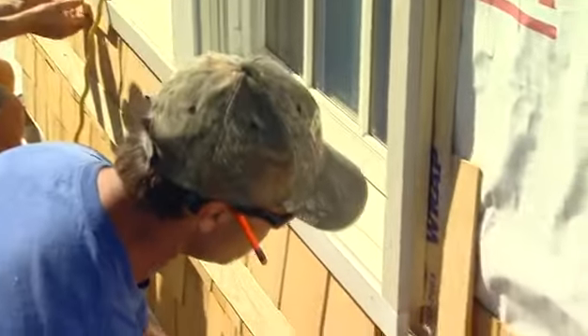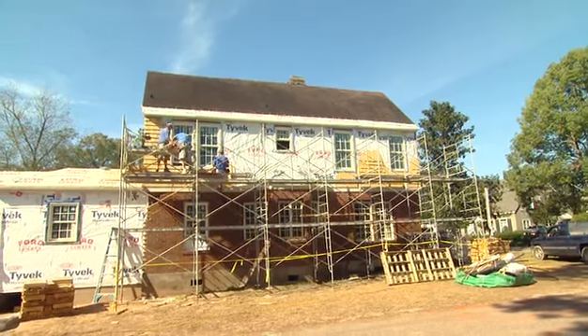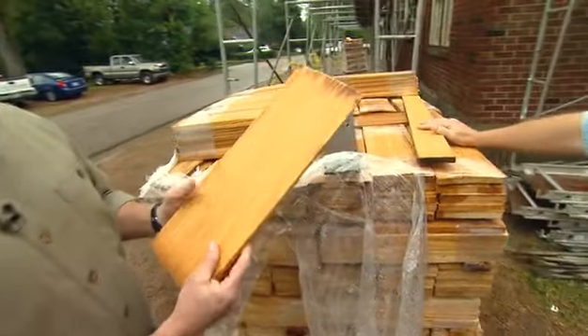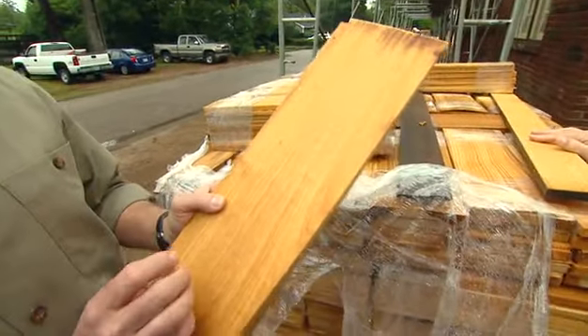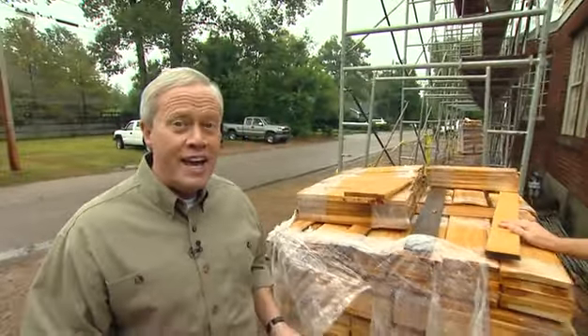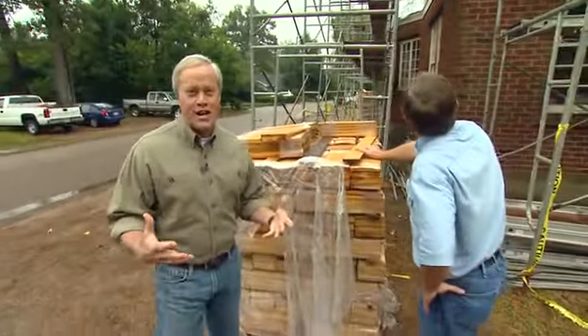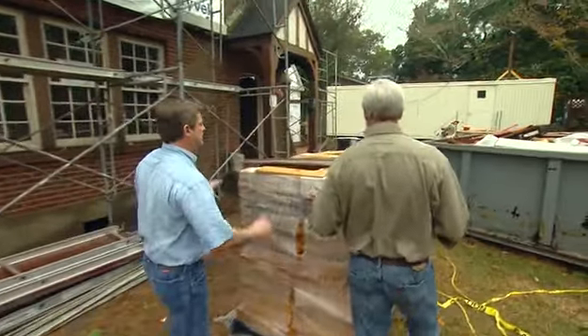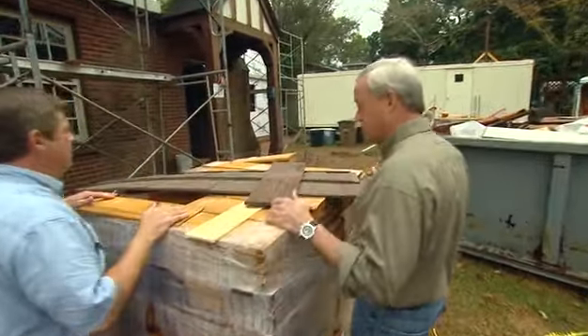They're making a pretty good bit of progress there, and it looks really, really nice. What we're using is a cypress shake on the gables of the Cupbersmith home, and the reason that we're not using a synthetic material on this, like Alan talked about earlier, is that this is such a character-rich house, and this is a big part of maintaining that character. Alan looked at all kinds of alternatives as far as other ways we could go with some synthetic material.